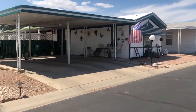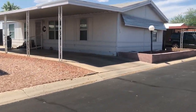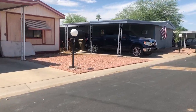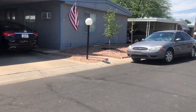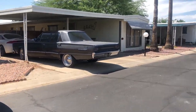However, pit set mobile homes are not ideal in every area of the country. In areas prone to flooding, these types of foundations can attract and collect water, leading to foundation problems, sinking mobile homes, stagnant water, severe mold problems, bugs, animals, and more. However, if you're in a relatively dry climate, a pit set mobile home may be right for you.